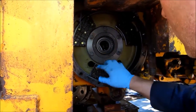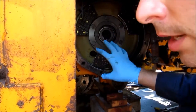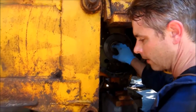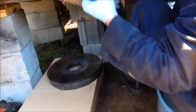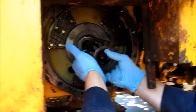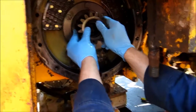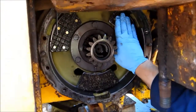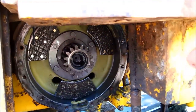The brake shoes and pistons are all the way in the cylinders, so now we're doing some reassembly — putting the pinion back in with the pinion gear and the sun disk. This is the sun disk I showed you before. Here's the pinion gear, and it will slide in where those splines are, all the way in as far as it'll go. You've got your brake shoes in these locations, and then the sun disk slides on top of this.